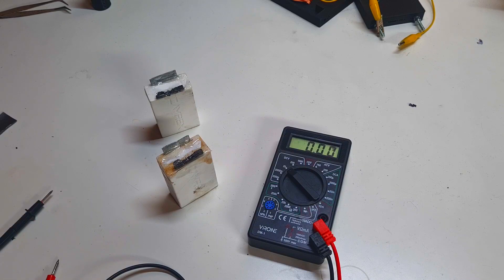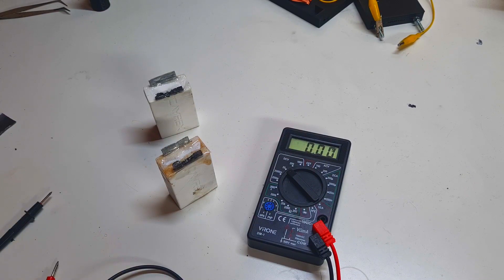Comparing this self-discharge rate to some commercially available batteries: the lead acid battery self-discharge rate is from 3 to 20 percent per month; the lithium-ion battery is from 1 to 2 percent per month; the nickel-cadmium battery is from 20 to 30 percent per month; and the nickel metal hydride battery is from 13 to 70 percent per month. The self-discharge rate of nickel metal hydride batteries is strongly dependent on temperature — higher temperature means higher self-discharge rate.